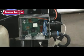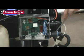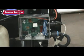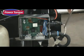A bit more detail on the fuse box. It's also an IP65 enclosure with four AVMs to enable fitment to an engine bracket or canopy. It has an integral PCB which, with the configuration of relays and fuses, makes it suitable for either JCB or SISU 12 and 24 volt variants. The connections onto the fuse box include the power and ground cables connected to the battery, not the starter motor; the engine loom; the control panel; and for the additional JCB 24 volt, an interface to a 24 to 12 volt converter and then the J1939 diagnostic interface for both JCB and SISU, though SISU has the addition of an interface loom.